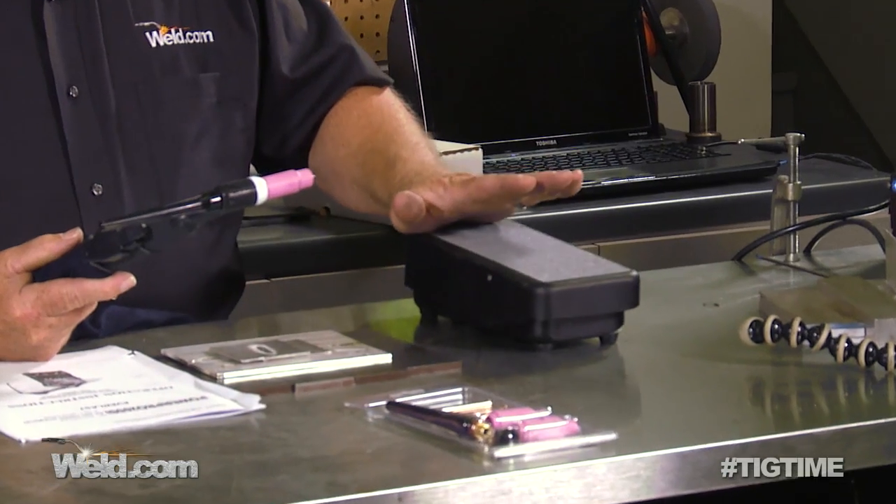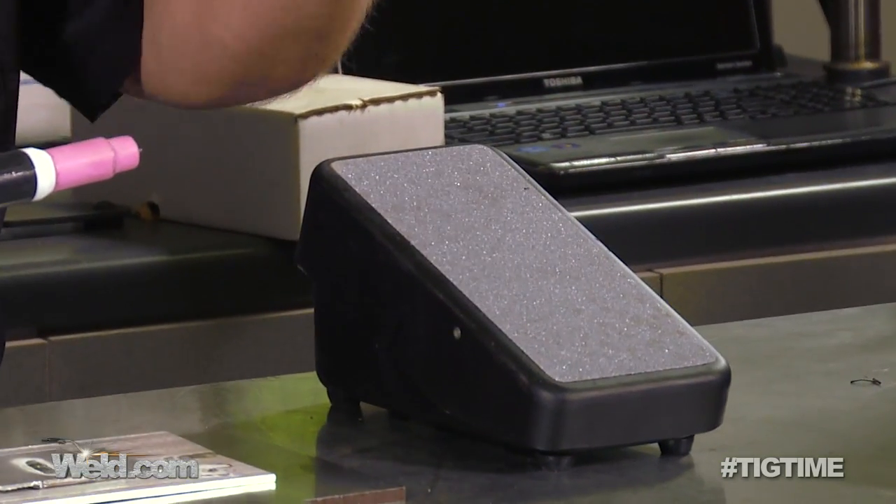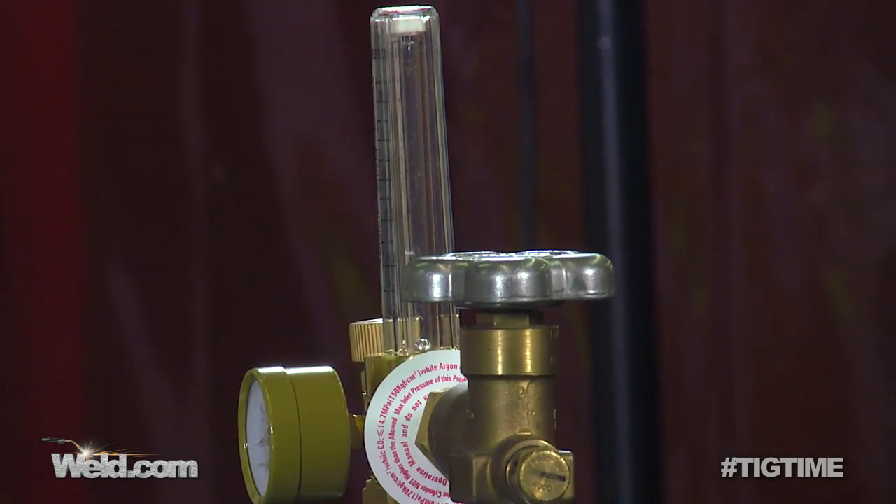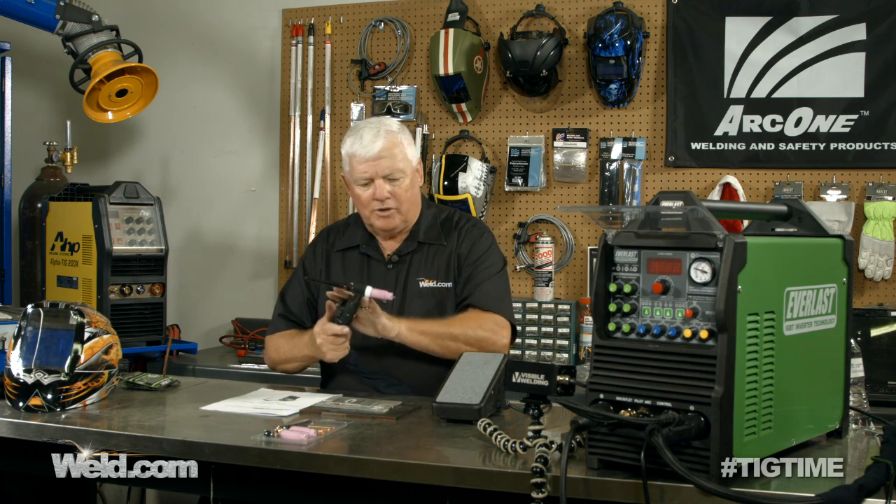The foot control is better than the old style, but you'll notice it's very narrow and the motion is okay. We're going to show you a couple of foot controls you can replace this with if you want — but these will get you by to get things going. Another improvement is that if you look over at the argon bottle, the increments are now in CFH, which is a real plus because all of our procedures in the United States are written in CFH. So I'm going to change out my torch, change out the foot control, put my gear on, and do thin aluminum — 16 gauge — and then quarter inch to test the high and low of the machine.